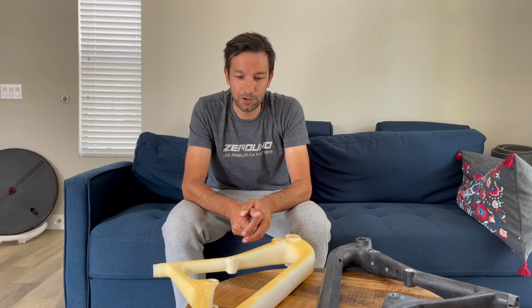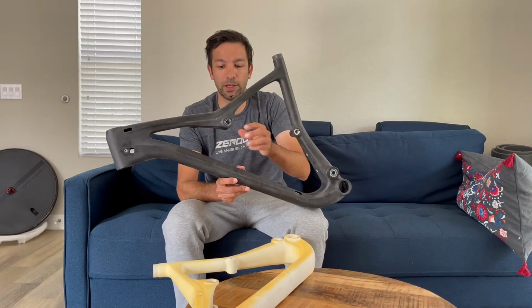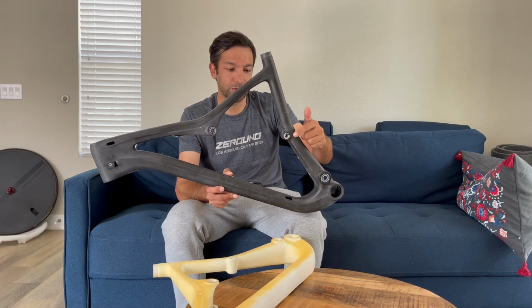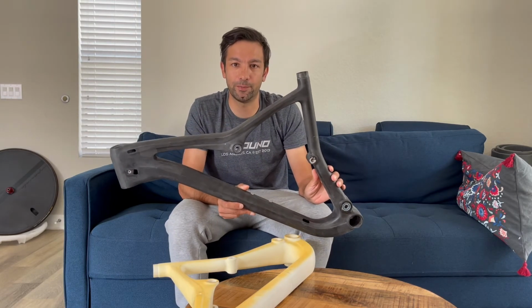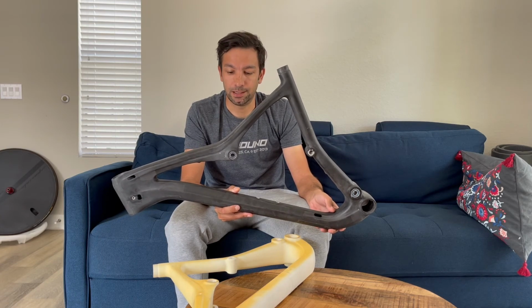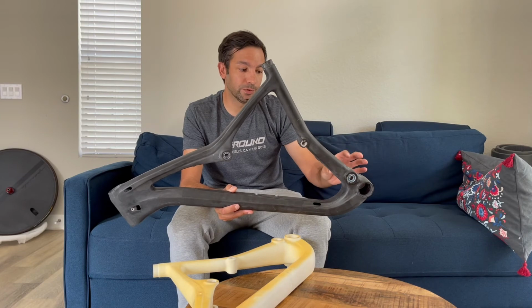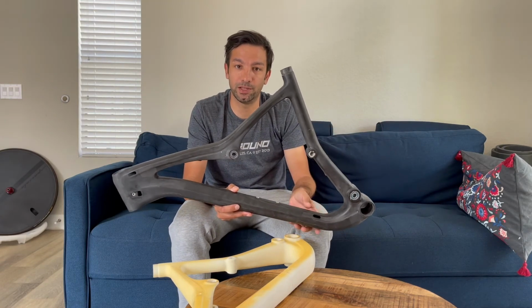Beside the following one, that of course takes a good piece of the cake on this part, we normally go our own way. So of course the frame would be much lighter if we went with bushings instead of bearings. See, these bearings are like 10 grams each, and there are 1, 2, 3, 4, 5, 6, 7, 8. That means we are talking about 80 grams heavier compared to another frame with bushings. But the thing is, with this system, first, the suspension works better. And second, I don't want to say it lasts forever, but it lasts forever, because when the frame doesn't work properly anymore because you didn't do much maintenance or whatever, you just swap the bearings with new ones and the frame goes back to being like a new one.